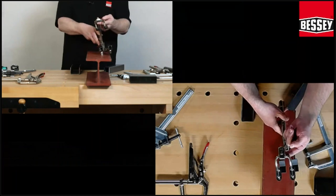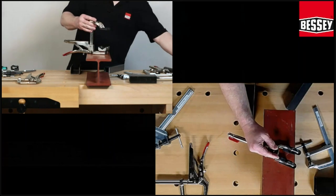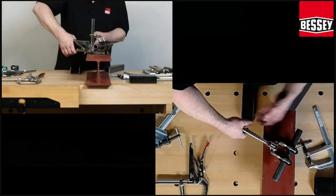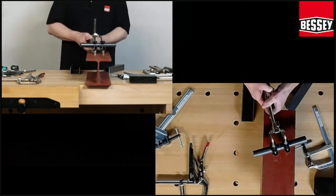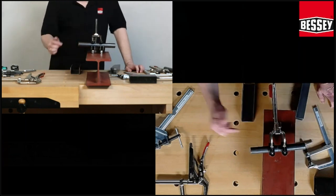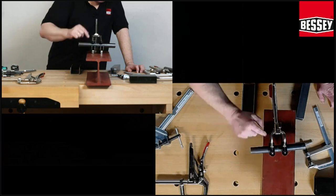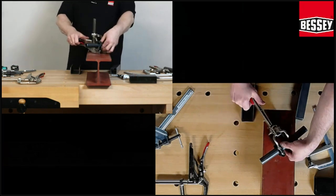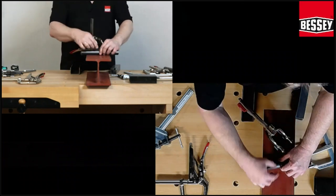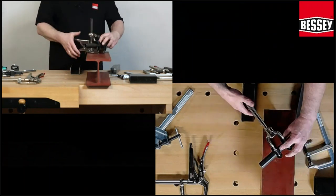Like this — you can fix big pipes. With this you can put two pieces of pipe together. When the pipes are in the pipe clamp, you don't need to weld completely — only the power welding points here, or for example welding points here. And then you can finish the welding completely inside the pipe clamp.